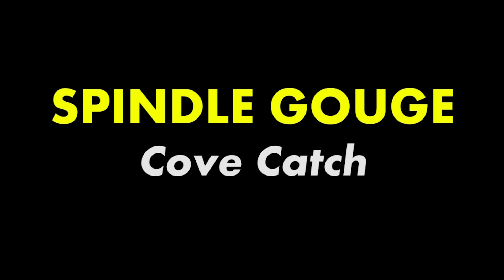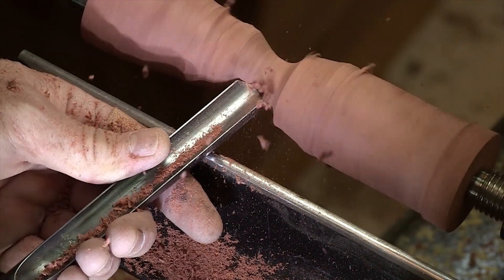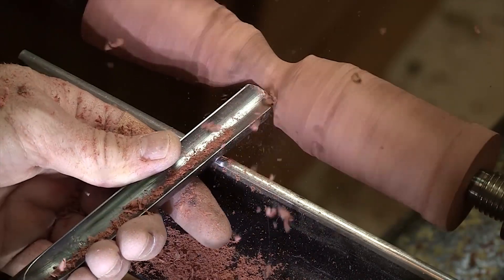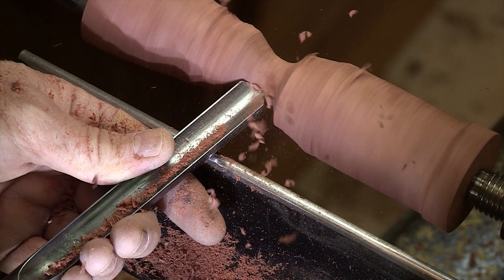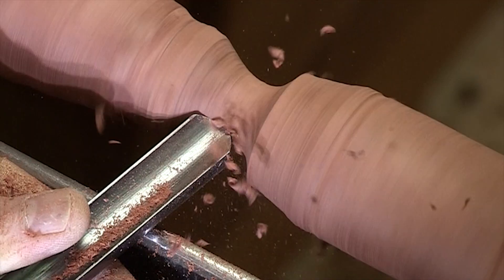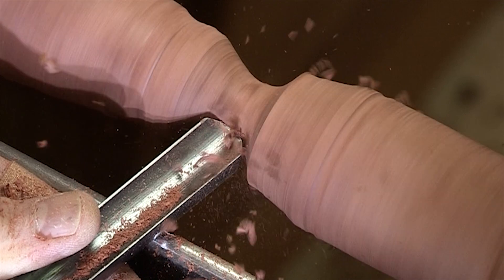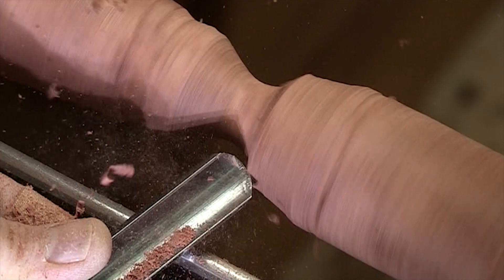When you're making a cove and get a catch, generally it's because you do one thing wrong — you try to cut uphill. We're cutting downhill, right? Downhill looks good, but watch what happens when I come to the middle of the cut and go uphill — it's really quick. I'm cutting with the edge, everything's fine. But now watch the right wing catch full face onto the wood. The end grain is pointing in towards the center, so it wants to climb up on top of the tool. All of a sudden we're exposing an unsupported edge of the tool — wham! It takes it, turns it over, tries to balance it out. Design modification.